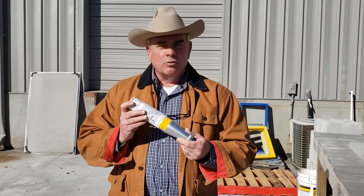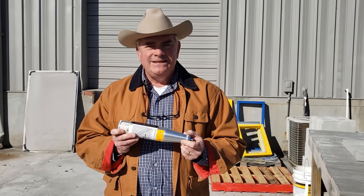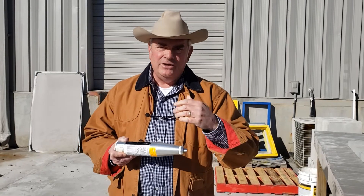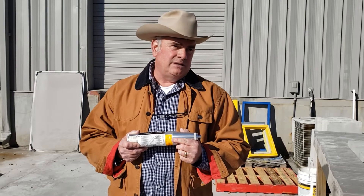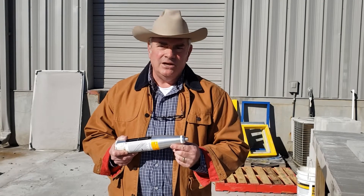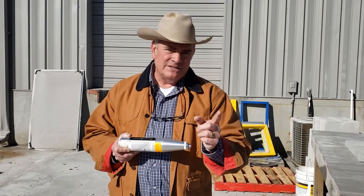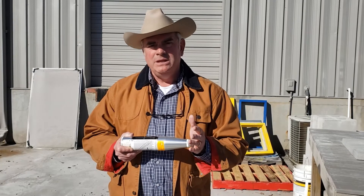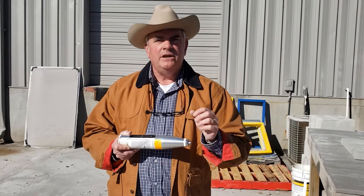To understand the rules behind this apparatus and the procedure, I refer you to ASTM C805. You're going to go on the internet and see all kinds of different instructions which, if they don't match C805, are opinions. It may be written by an engineer, but still, the whole key to testing is to be on the same page universally, so no matter where we are, we're getting results that can be compared. So do yourself a favor — stick to ASTM C805.